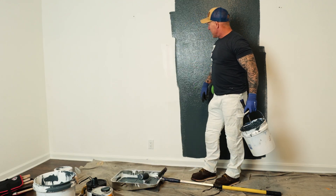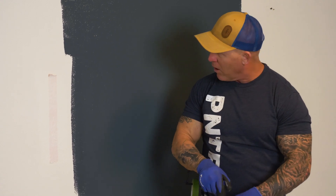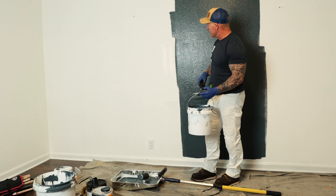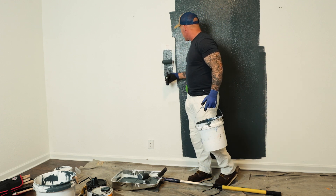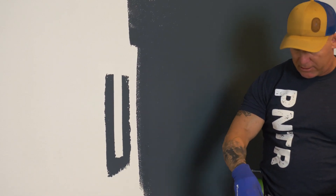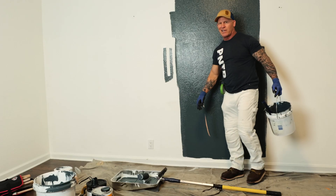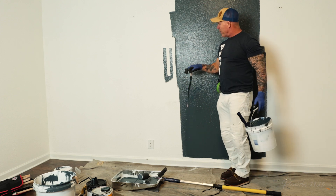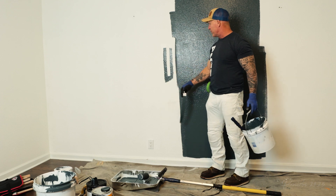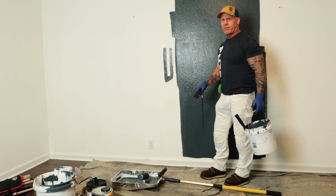I got on my last tape line right there and we painted the white on it — it's been probably 30 to 45 minutes — and I'm going to paint over it. You can already see the tape is lifted up on some of the edges, so this method is never as foolproof as caulking with green Frog Tape. Not too bad — but it bled pretty bad on the bottom, fairly straight overall. You can see why, if you really needed a perfectly straight line, painting the other color over the top is not as great a method. Just gotta be very particular about pressing your tape down really good and tight before you paint.